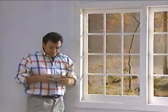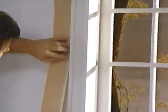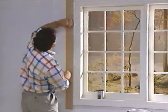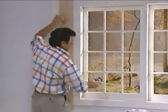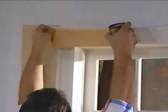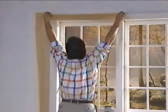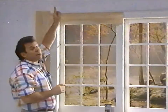The paper version has a built-in cutter and the masking tape is attached to the paper. You use this when you want to protect your walls when painting windows, doors, or trim. All you do is pull it out, put the tape on the wall, and follow it right down along the window frame. When you get to the bottom, tear it off with the built-in cutter. It's specially treated so no paint can bleed through onto the wall. You can also use it to protect the door from paint coming from above — just take it to the edge of the door frame, place the tape at the top, make a little crease, and it'll hold in place.